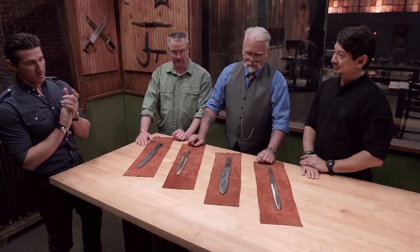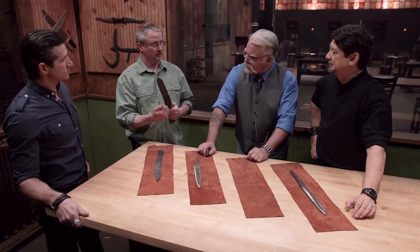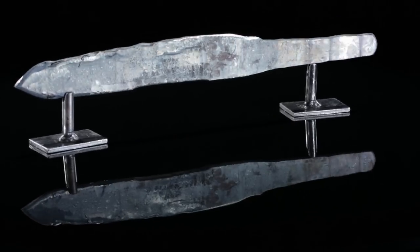Let's move on to our next bladesmith, Francesco. As soon as Francesco added this tip, he should have gone right into the forge and right into the oil. He had the time — about 10 minutes, maybe a little over. It would have been enough time to get this blade hardened up, and that would have made a huge difference. It definitely would have put these two into much closer contention. I don't understand the late quenching. You can quench a blade and still work on it, and by quenching earlier, you have the opportunity to fix any problems that come up in that quench.